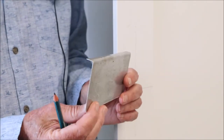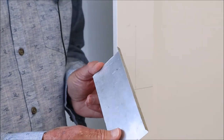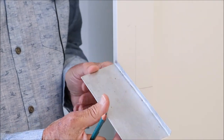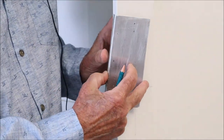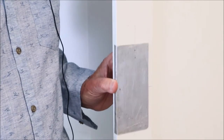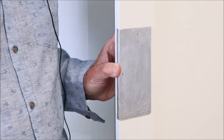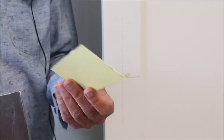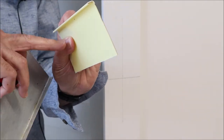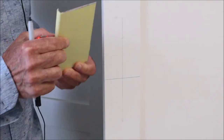For the template you need some sort of material. I like to use metal because it lasts better and you don't distort it that easily. You need something that's got a bit of a lip on it, because that lip is going to give you a stop on the end of the door so you can slide it up and down and move it to where you want, but it's stopped against the door giving you the same position every time. I've cut this out of a piece of aluminium plate, but you could quite easily make it out of plastic.